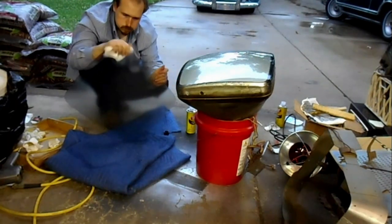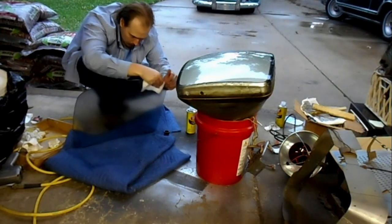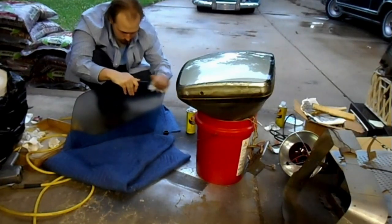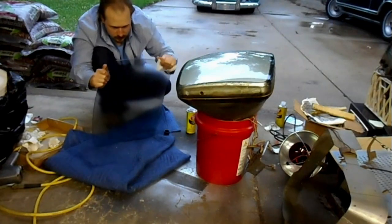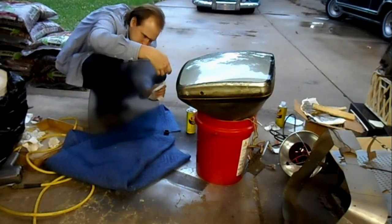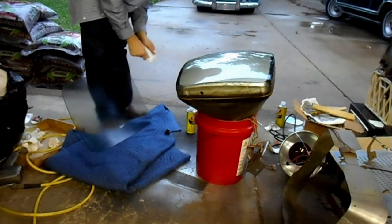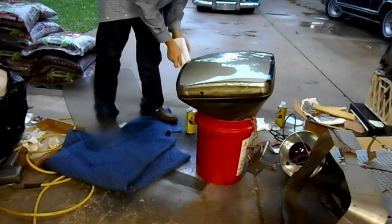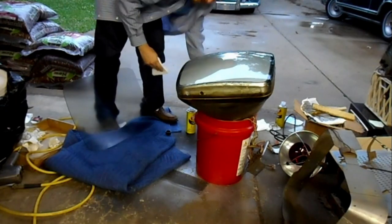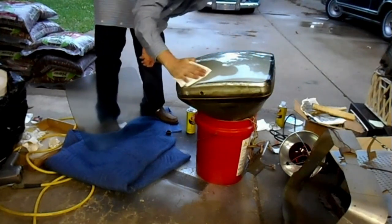I'm glad I picked today to do the Zenith CRT removal, because with the rain and overcast, it wouldn't have been a good day to do the RCA CRT removal. And the next day was a nice sunny day, which made for great weather for doing an RCA-style cataract removal. Whenever you can preheat the tube in the sun, that's vastly preferable to operating purely with heat lamps and the assistance of heat guns. The guns and lamps are helpful, but it's best to do it with the sun first.